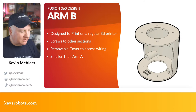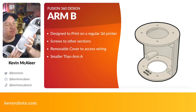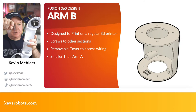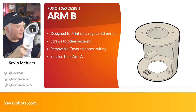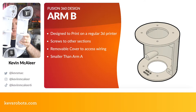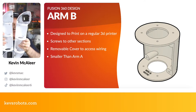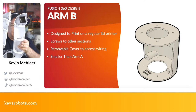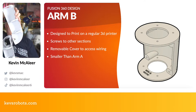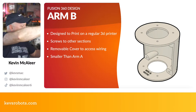So the reason I did that was, potentially if you've got this bolted to your desk and you wanted it pointing inwards instead of pointing that way, then the next piece that bolts into that, if you imagine that this was here, it would need to be smaller than this one, otherwise it would clash with it as it turned round. You want it to be able to turn round 360 degrees. Alternatively, you can just print them in that kind of orientation, like so. So, there we go.